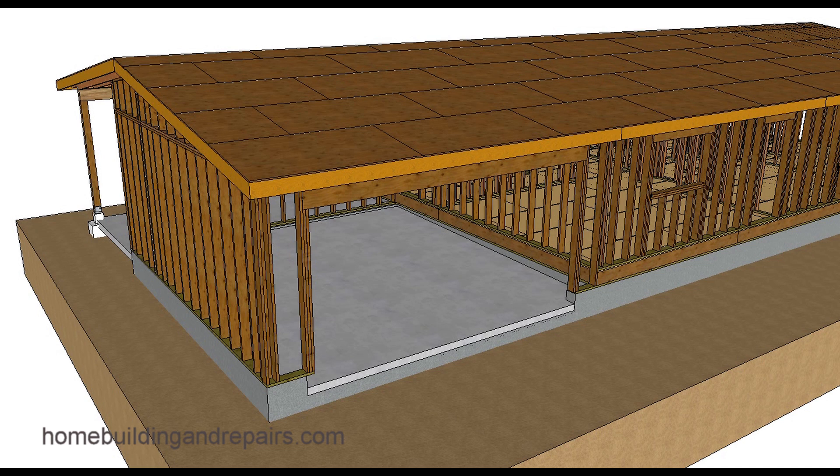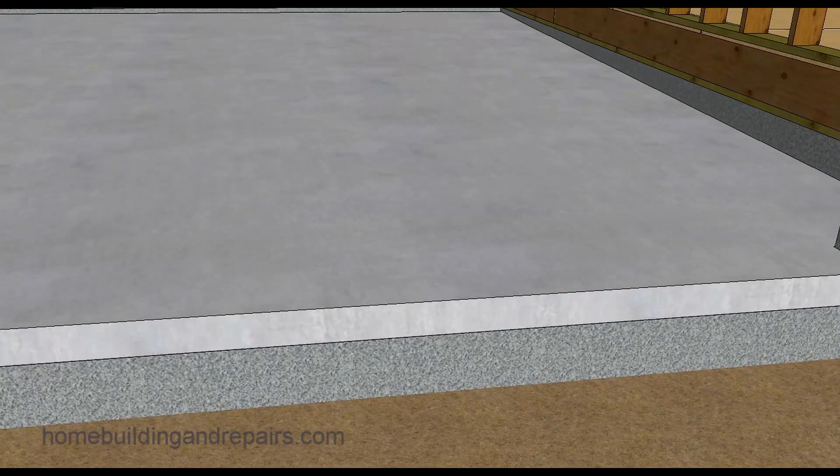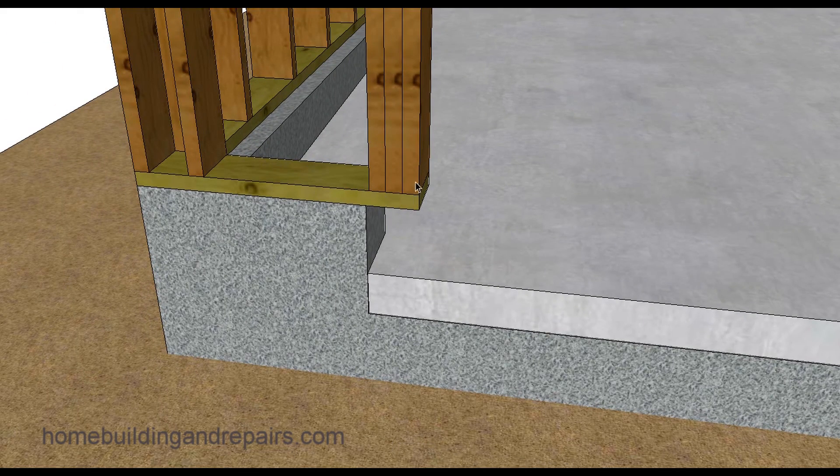Here's a problem you might run into while working on a project — framing a garage door opening and missing a concrete footing or a section of it. I ran into this problem quite often years ago. You'd go to frame something and there wouldn't be anything supporting the trimmers. You can see here there's nothing underneath — the concrete footing stops here — and realistically it wouldn't be supported.